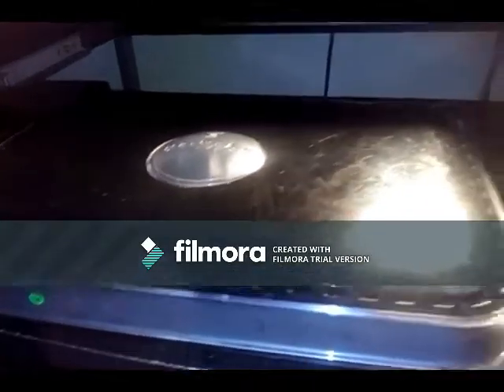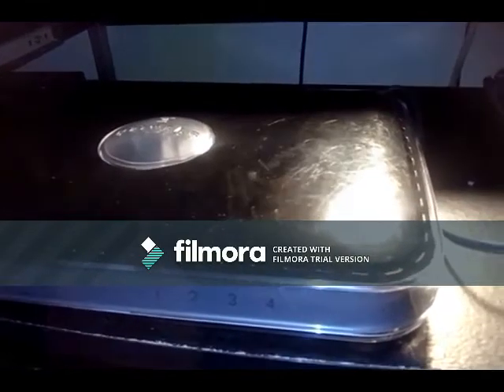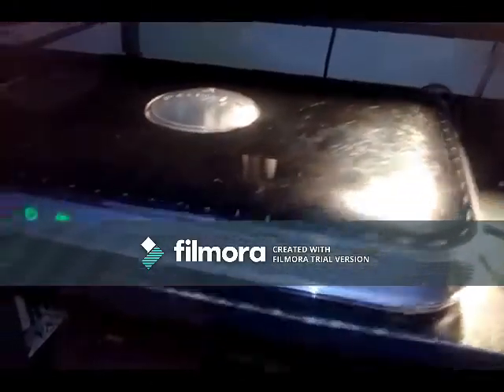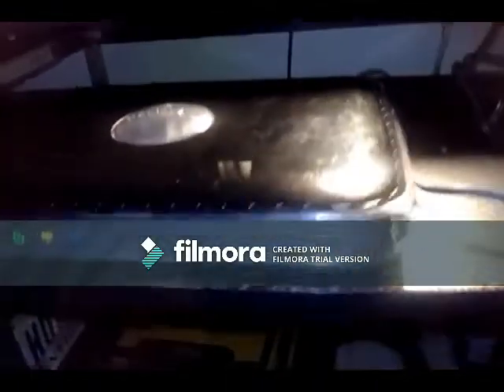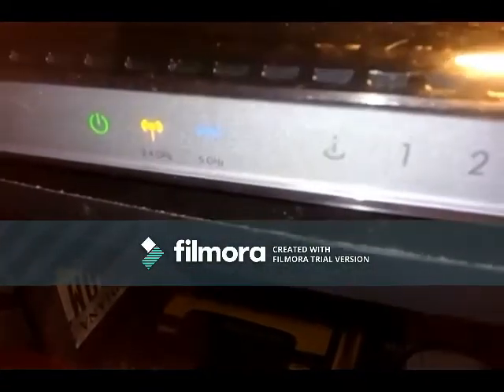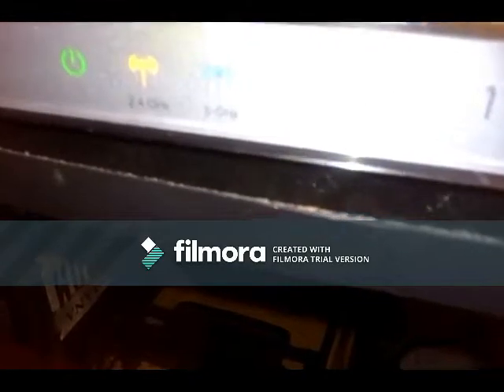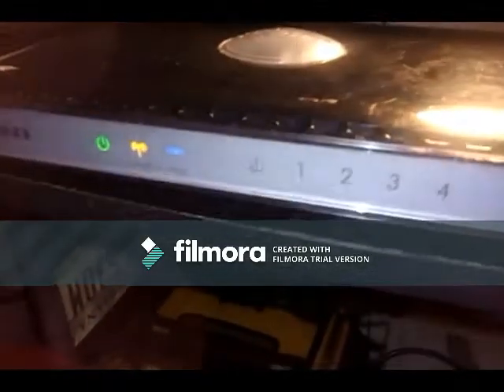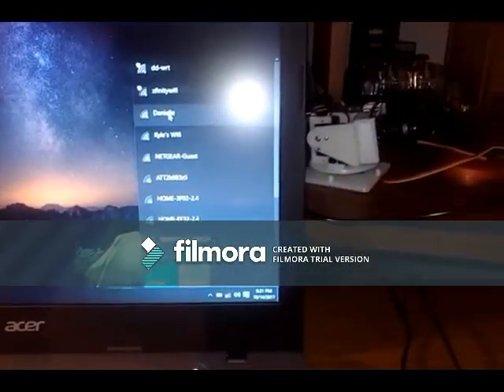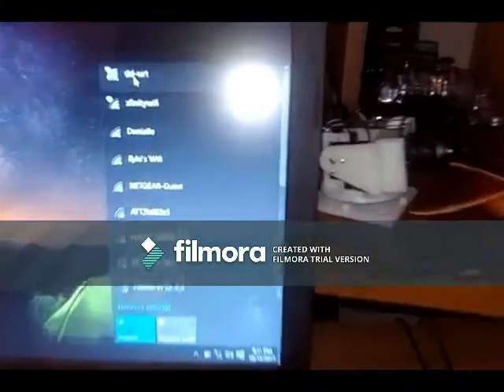Now in the Arduino I wrote a small sketch that to begin with starts with a delay — it will not do anything for 60 seconds, which is more than enough time. It actually takes like 50 seconds for the router to boot up. So all these messages that come through the debug port, like processor speed, frequency, memory size and everything, are passed. So the Arduino will not receive any of that.